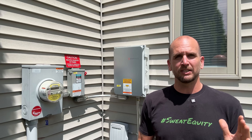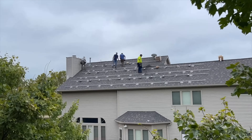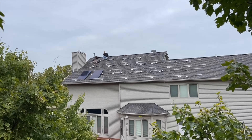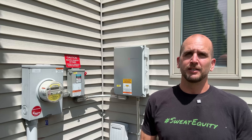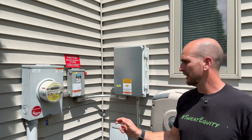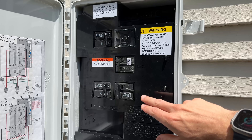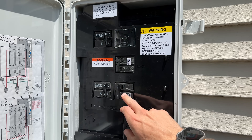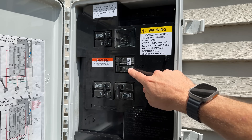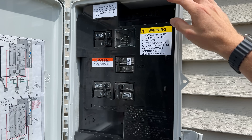I have 11 kilowatts installed on the southern-facing side of my home, standard IronRidge rail setups, and you can see the little boxes which are all Enphase micro inverters installed underneath the solar panels. The solar panels are installed and that is 240 volts AC that comes together and comes into this combiner box from Enphase. We have three separate branches coming from that 11 kilowatts.